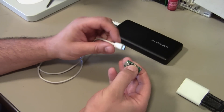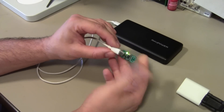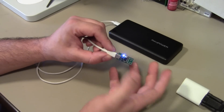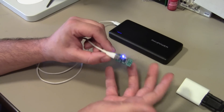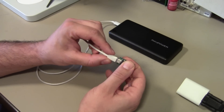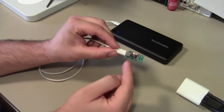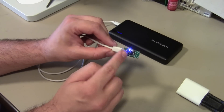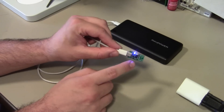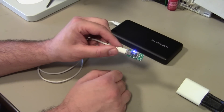Again, if we want to change it, we can hold the button down and plug it in — you'll see the RGB LED sit there in rainbow. Then we can toggle up to green, which is a fixed 12 volts; teal, which is a fixed 15 volts; blue, which is a fixed 20 volts. So if I always wanted 20 volts, I can just hold the button down again, the light goes out, at which point it's saved. Every time I plug this in, it'll negotiate up to 20 volts. You'll notice it started blue — showing you what mode it's in — then dropped down to red, meaning it's currently getting 5 volts, and then it negotiated up to 20 and flipped to it.